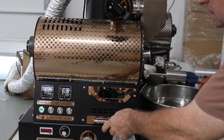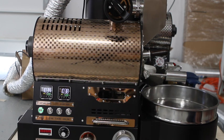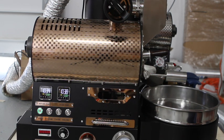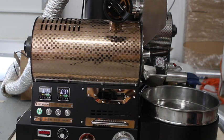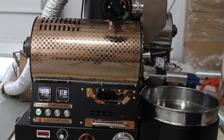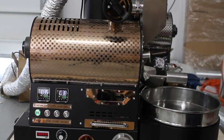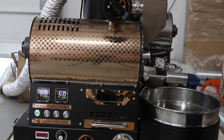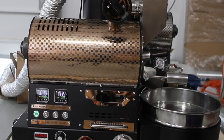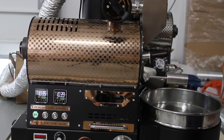These are solid stainless steel drums — 304 stainless — which is really one of the highest quality stainless steels, having the most nickel content. You can get these in double wall, but we don't usually recommend it. The biggest advantage of double wall in a smaller roaster, maybe five pounds and under, is really that it allows you to do smaller sample batches. In a single wall drum, you can easily avoid any uniformity or tipping problems without much issue.